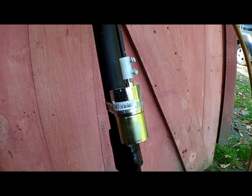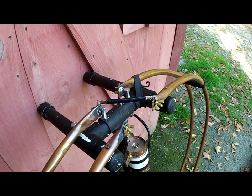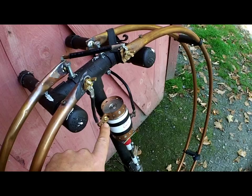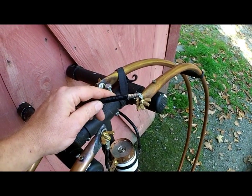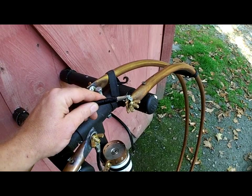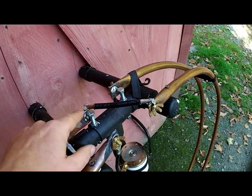Let me go through the current setup quickly. The loop is configured right now for 40 meters. I've gone from flat heat straps to a very large — I think maybe 4 gauge — wire with soldered ring terminals. Currently this jumps from the termination of the first loop to the start of the second loop.